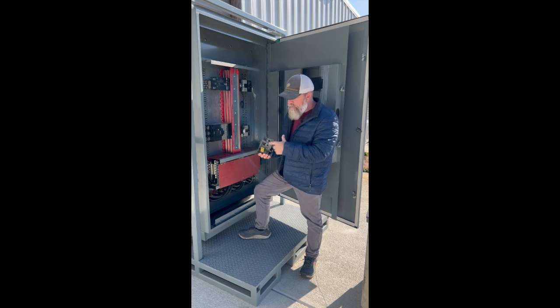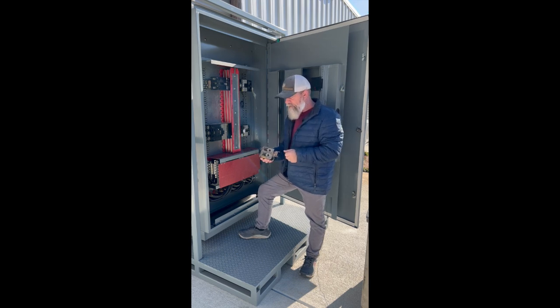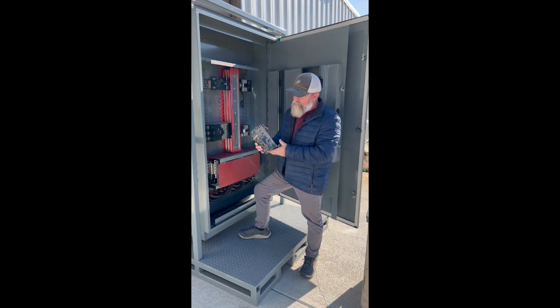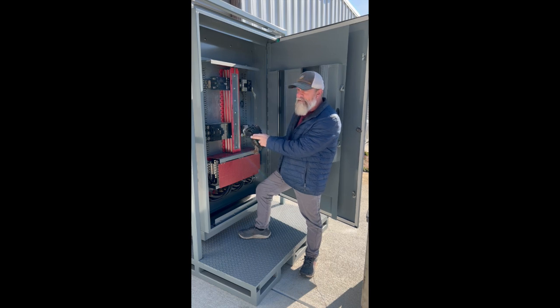Moving on, the lugs — where the cable connections go for your load side of the breaker — they're really nasty, corroded, and just nasty. They need to be cleaned, lubricated, re-cleaned, and exercised. It doesn't take long — it's the little things that if you let them build up, you end up having something that looks like this. It's a housekeeping thing; somebody had to have seen this. It should have been cleaned before it was ever put back in.